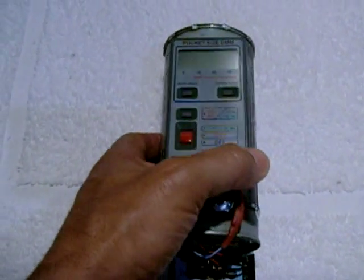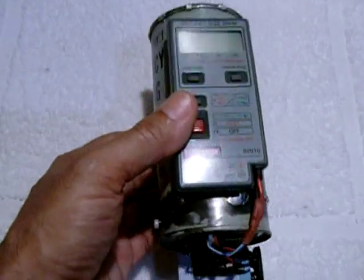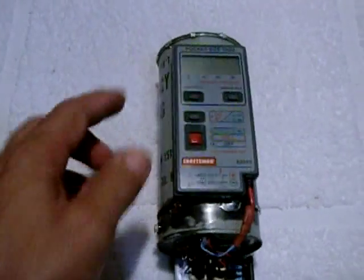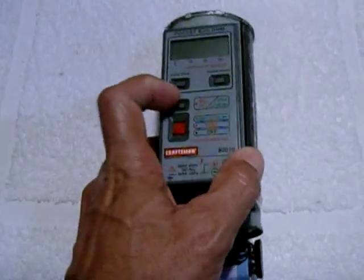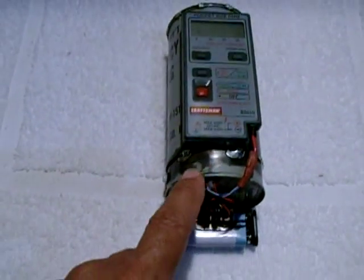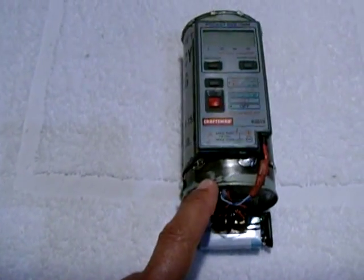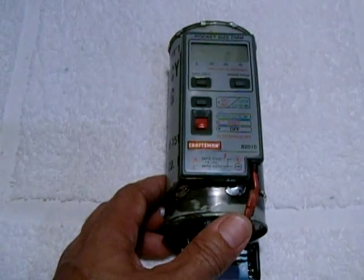This is another radiation project. Listening to all the Fukushima news of the ongoing meltdowns and radioactive water made me want to work on this other project I had going for a while. If you go back to my video list you'll see this exact same ionization chamber with the DMM attached to it. That particular unit used two pairs of Darlington transistors — one set of NPNs and one set of PNPs — to create the sensitivity, but I was still looking for better.